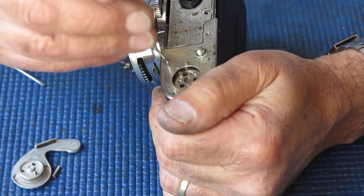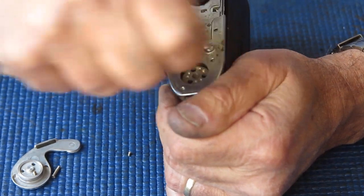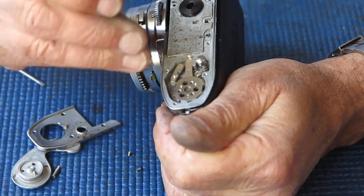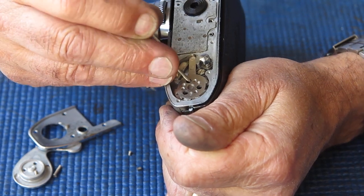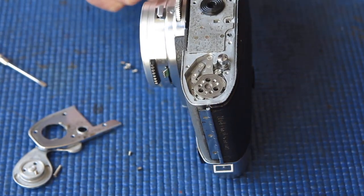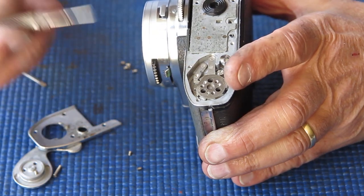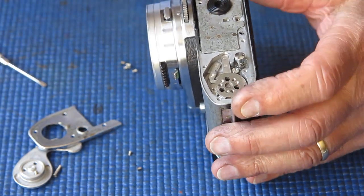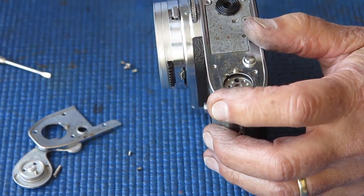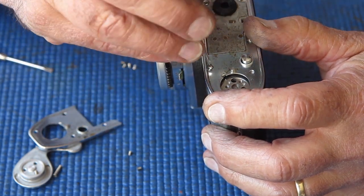And it's handy to have a base plate on the camera while you're working on it, because it stops the spring here for the capping plate and the spring here for the advance lever from getting away and causing you grief. If that spring in particular, if you press the release lever and that spring comes up over the top, inevitably it gets caught on something, and you're having to take everything apart again to remove it and try and straighten out the damaged spring. So now we've done with this, so I can put the full base plate back on